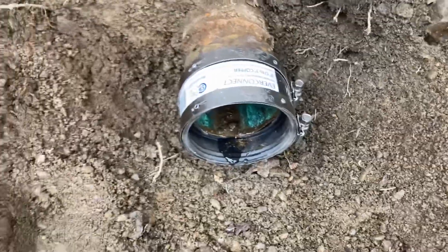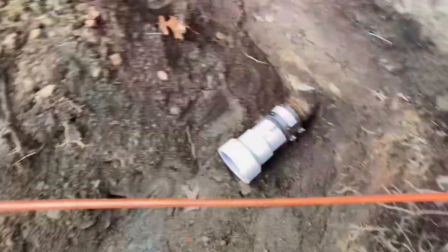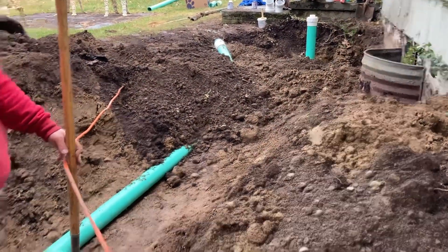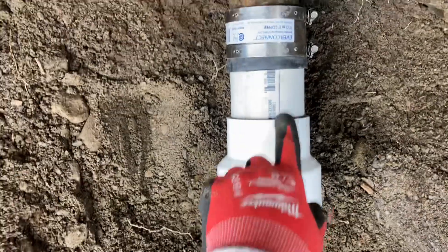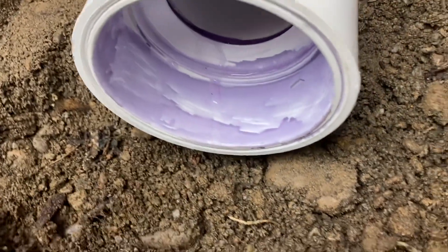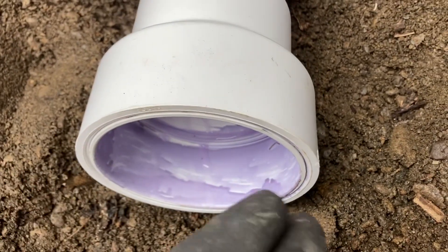Coming in here, still coming out right here. Hydraulic cement action. Starting the backfill — boys are putting good dirt in the trench, making sure it's pitched correctly so it's going to stay that way. Got our connections into the septic tank. It's copper penetrating the foundation, so we use transition bands, copper to Schedule 40 plastic. We're going to run a bell reducer here so we can get up to 4-inch outside. Then we have an SDR 35 by Schedule 40, with this piece solvent welded into our bell reducer so we can glue the SDR into there.